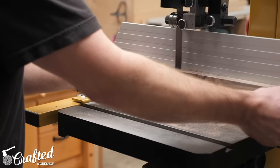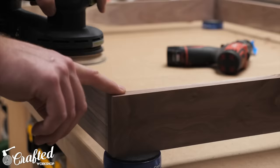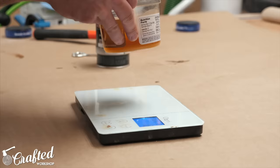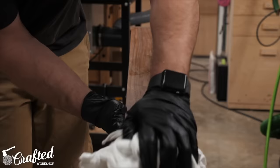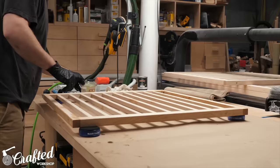With all the pieces finished, I sanded everything up to 180 grit to prep for finish. I made sure any rough edges were sanded smooth — the last thing I wanted was my kid getting a splinter from the crib. For the finish I used Rubio Monocoat, which is a 0% VOC finish and is food safe after seven days of cure time. I used the two-part version with the 2C accelerator, which really speeds up the cure time. As the name implies, Monocoat only needs a single coat — I just wiped it on using a rag, let it sit for a few minutes to react with the wood, and then wiped off the excess.